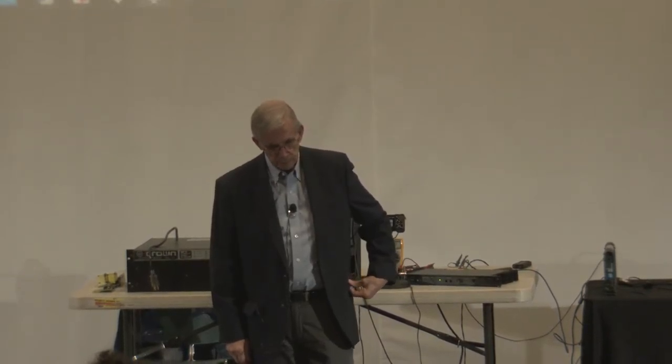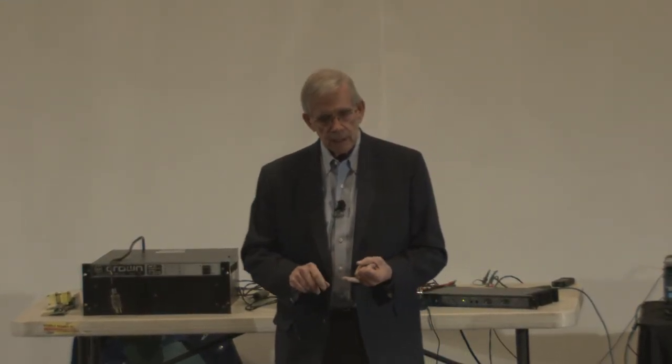Yeah, Austin. So with Class Ds, you talk about output filtering. What determines poor output filtering, and what is that perceived as? Well, anytime you filter something passively, it involves a capacitor or an inductor. Capacitors and inductors all have a phase shift, what they call a Hilbert transform, and so the problem with the output filtering is that what you get in isn't exactly what you get out. Plus the fact that filters ring